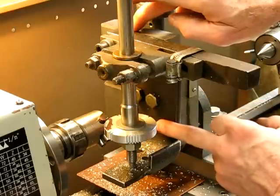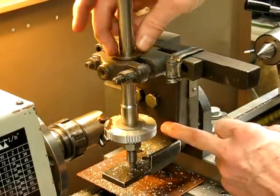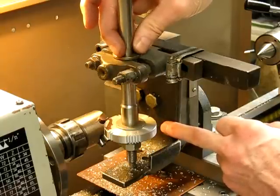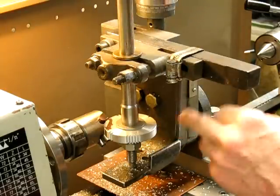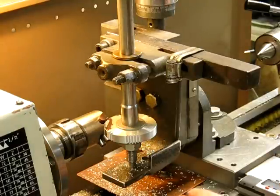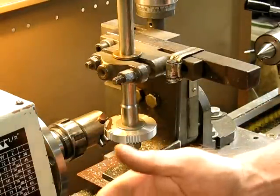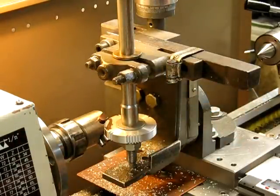Having that as a bit of a pivoting point works quite well, because this is totally rigid — when you pull up your clamp, it basically self-centers the shaft so everything lines up absolutely perfectly. You have to have your shaft vertical on this plane and also at 90 degrees to the horizontal in both directions, so you've got three planes to worry about. But that's it — it's not difficult, and yes, you can make gears very, very cheaply.